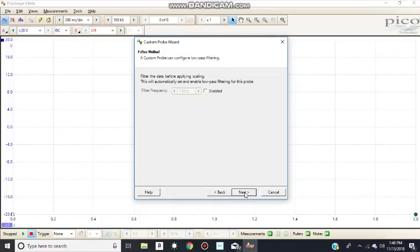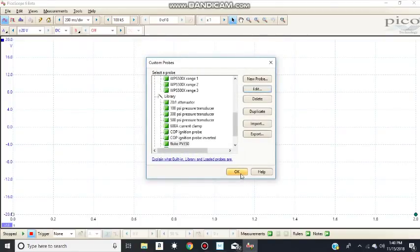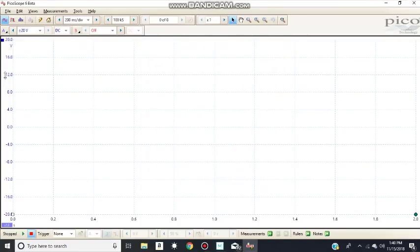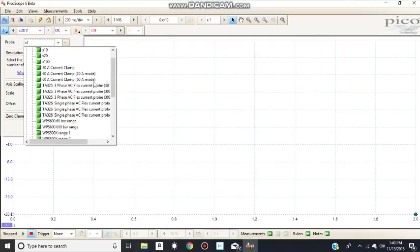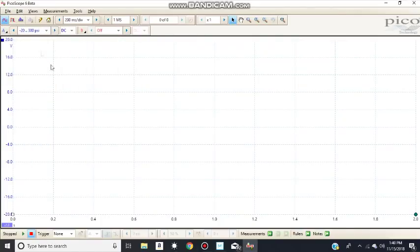Go to next. I do know you don't need to do this — we're going to filter this later on. Just name it PV350 and click Finish, click OK. You're done. So now we're going to choose our pressure transducer — the 350 — and I'm going to use 100 PSI. Select 100 PSI, and now the time.